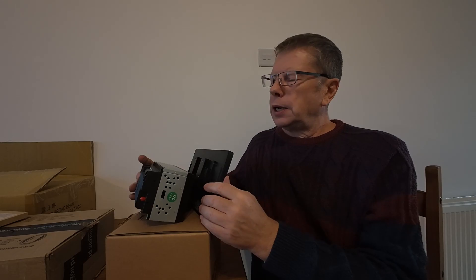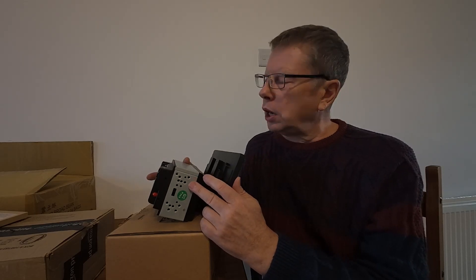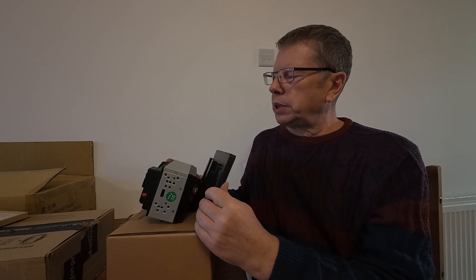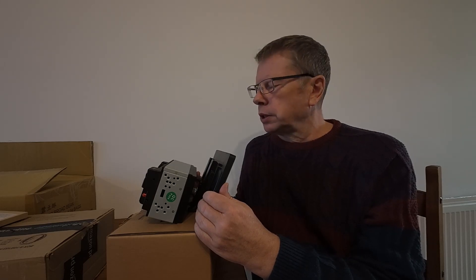I've previously made a video on the 7 inch double DIN UA13 and showed how to disable the microphone on that unit. The UA13 Plus has a 10.1 inch screen, so it has the same basic double DIN size base unit. It's 180mm wide by 100mm high and about 80mm deep, but rather than the 7 inch screen it has a small gimbal and a 10.1 inch touchscreen. The touchscreen can be tilted side to side and up and down, and it also slides up and down by about 40 millimetres, so very flexible installation options.